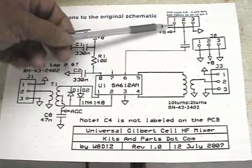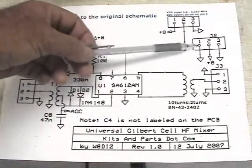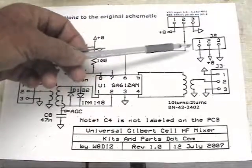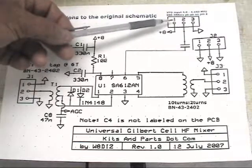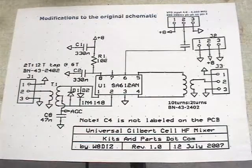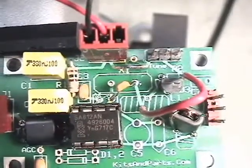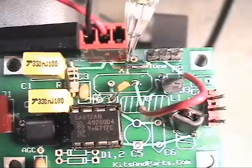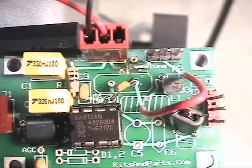Let me warn you: if you do that, be careful, because this connector is not the same as the others. Most of his other connectors have pin 1 and pin 3 as ground and pin 2 as plus 8 volts. If you hook up a connector cable made for standard power, you'll be putting a ground across pin 1 here, and it will burn the trace out on the board — unless your power supply is current limited. The trace becomes a nice ugly black and is no longer conductive; it acted like a fuse.